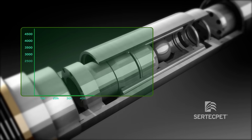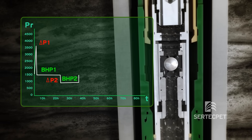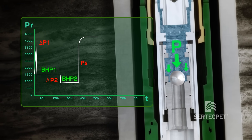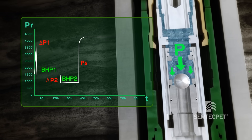The hydromechanical valve included in the smart jet pump facilitates the passage of fluids. When pumping is stopped, the valve closes by hydrostatic pressure, instantly restoring the reservoir pressure and thus avoiding wellbore storage.